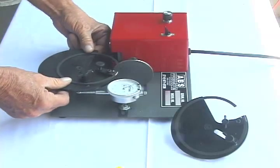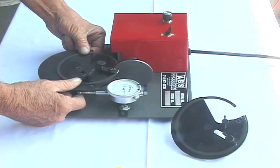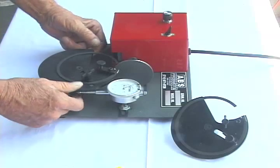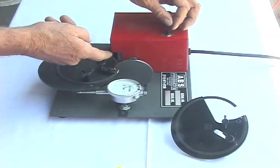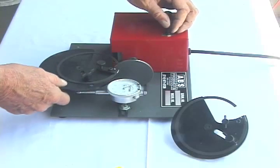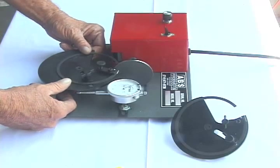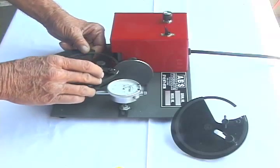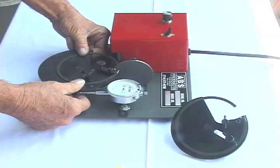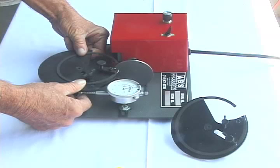It's got all that horsepower — you drive it up, stick it in there, center it in the turntable, take a reading. You want to take five thousandths off — there's five thousandths, dead straight, perfect. We've got all this adjustment so you've got three times the usage going across. The reason why we did that DC motor is it makes full power — we can adjust it to the hardness of the ring and to the proper cutting. Everything takes a different speed, that's why we get that beautiful cut. We don't get the heat — we can do tool steel, anything you want to do, and it don't turn blue.